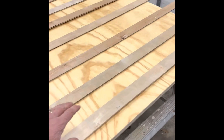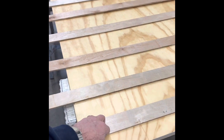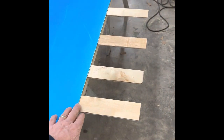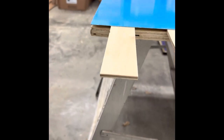The next step, now that it's dry and tacky enough, is to put strips down to keep the two surfaces from bonding prematurely, because if they touch, you won't be able to move them. You put these spacers down until you get the aluminum lined up the way you want, then pull the spacers out one at a time. We've got the aluminum laid squared up with the edges on top of the shims, then rock the shims to break the bond, slide them out, and use a roller to press it in.